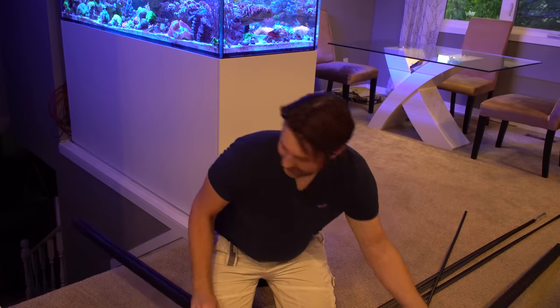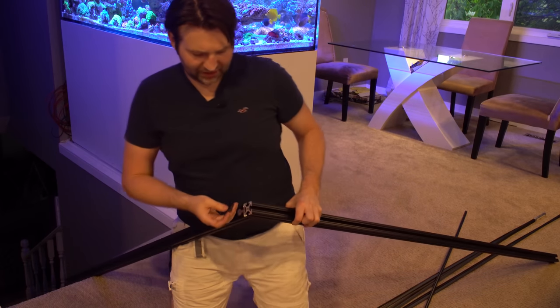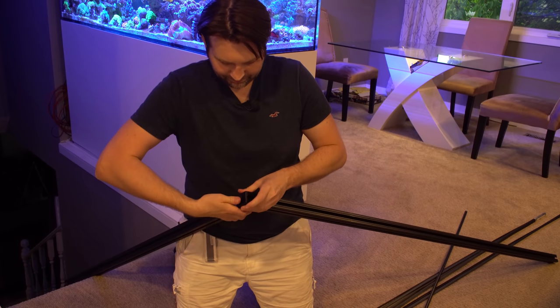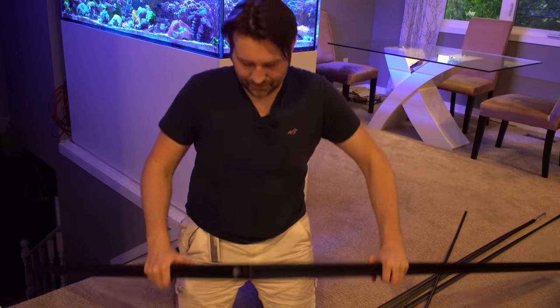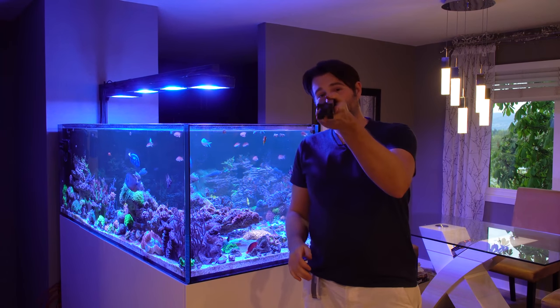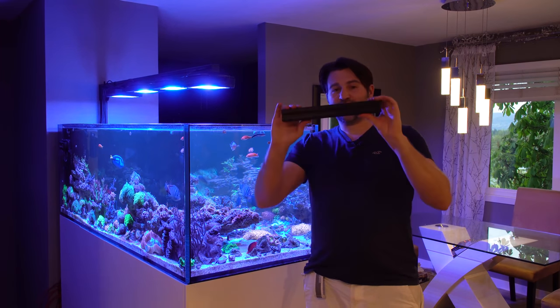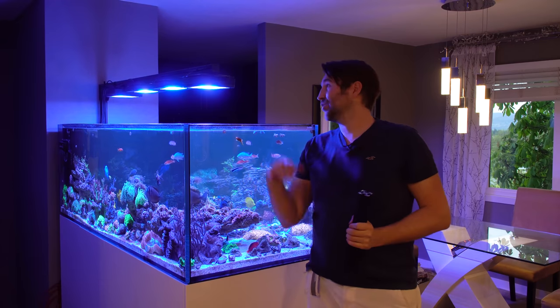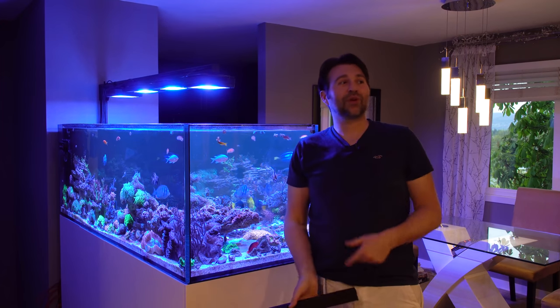It's really easy to build a very cool light bar out of 80-20, and if you've never used this stuff, it's pretty much like big Lego — you can build just about anything out of it. To button up and clean up the ends, I've got these little end caps for where the cuts are. Just poke these into the exposed aluminum and it ties up the end, giving you a nice black flush soft edge. The 80-20 is really cool stuff, and the 1515 gauge with that inch and a half resists any sag or deflection over that distance — especially with four or five Radions on it.